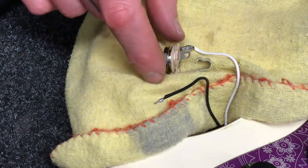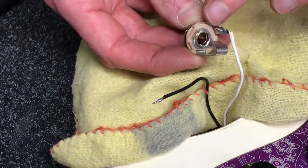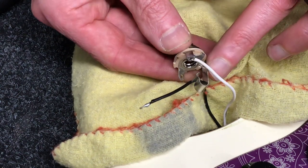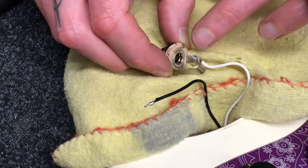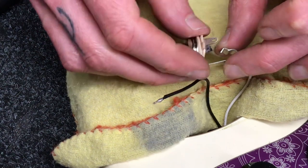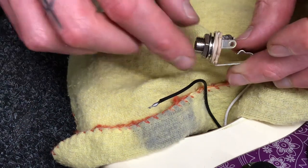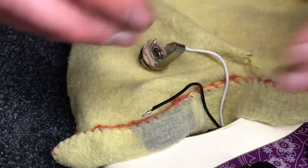On the new Switchcraft I've just scuffed up the lug. This is the ground lug — you can see where it's connected to the center part, which is where the sleeve will go. You can trace the tip pin around and see it comes round to that lug. The ground to sleeve connection is impressed in there. I like these Switchcraft ones because they're better quality — they're pressed and folded together so they don't move about. The cheaper ones can tend to spin if they're not well made.